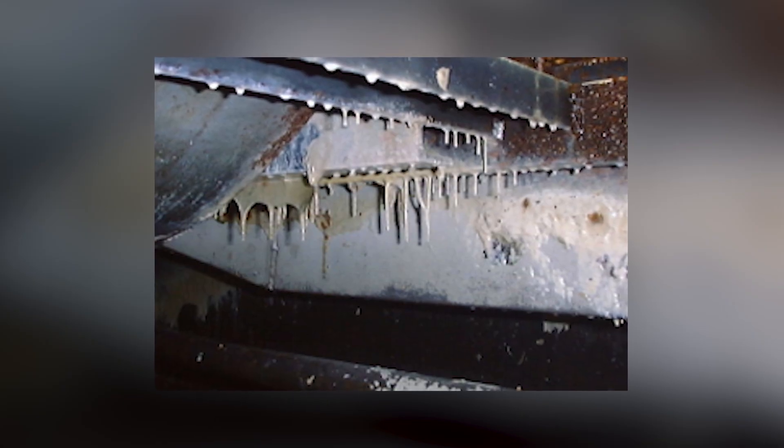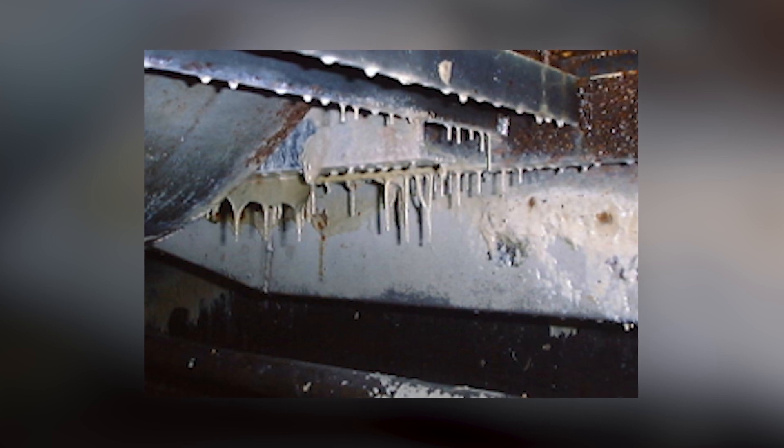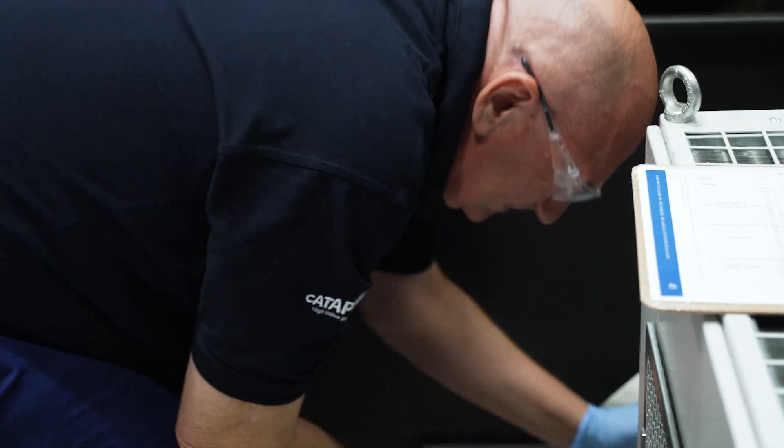Check for the presence of slime and deposits on the surfaces of the sump and on filter surfaces. If these deposits are not cleaned, a thick visible slime layer called biofilm may form. Also check for blockages that may affect the flow of coolant.